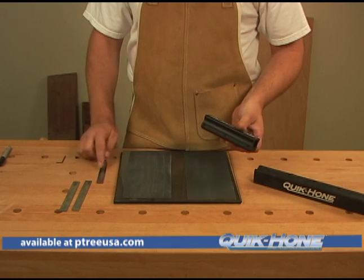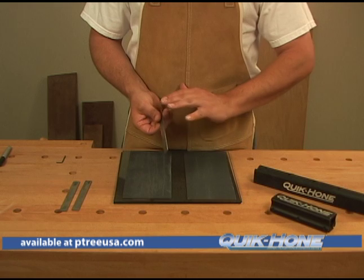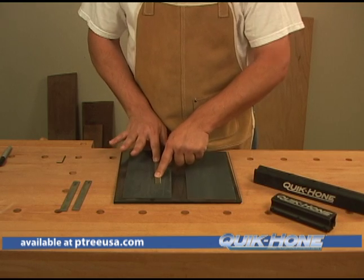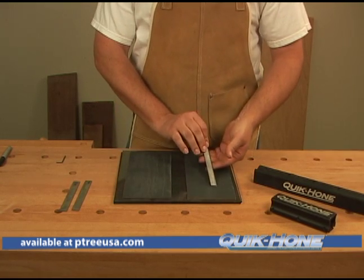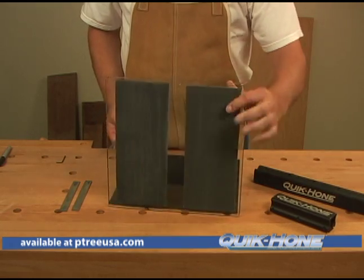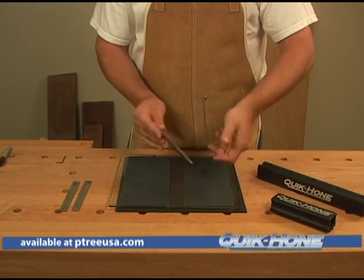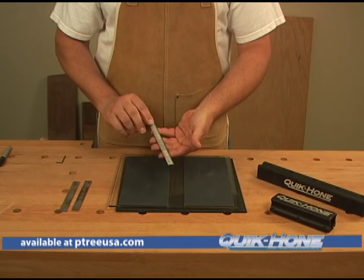The very first step is to take your knives and flatten out the backside. I would recommend putting on a set of gloves so your fingers don't come across that sharp edge. Take the flat surface, place it down on our 320 and work from the top side, giving it 10 strokes on each knife and check the back to make sure it's nice and flat. Go through all the grits — 220, 320, 10 strokes, then flip the system over to the 400 and 600, 10 strokes each. You'll get a nice, clean, flat back surface on your jointer knives. Continue that process on all three knives.